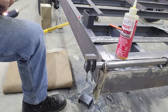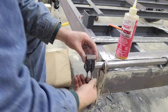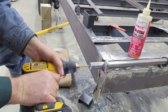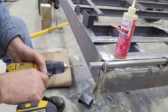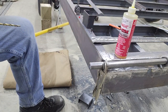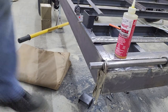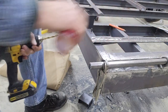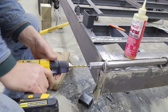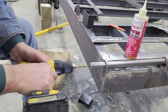I think I'm probably a good 3/4 inch into there. So let's take that off. Should be deep enough there by the time you count the cap. Let's get a drill bit for 5/16-18, that'll be a letter F. There's the bottom of the hole.